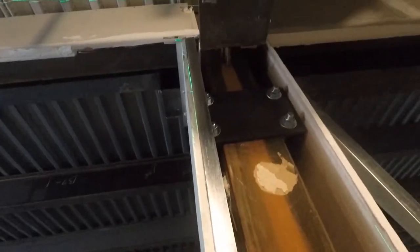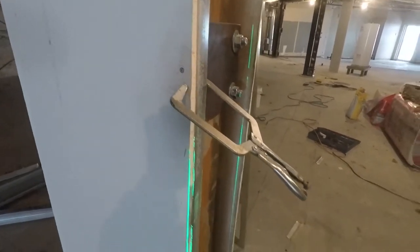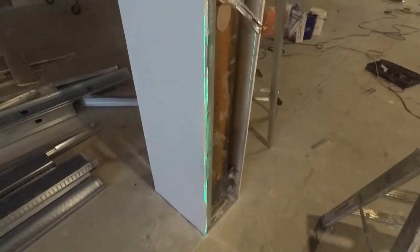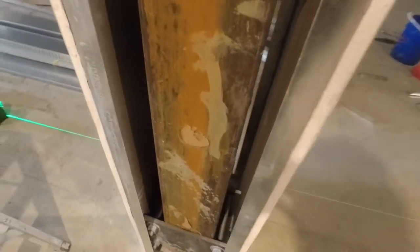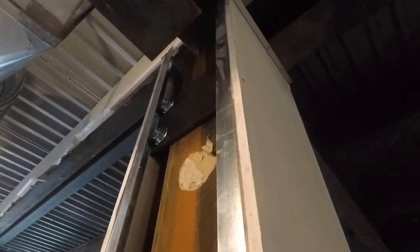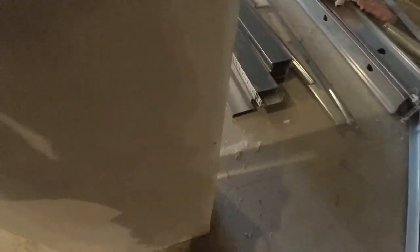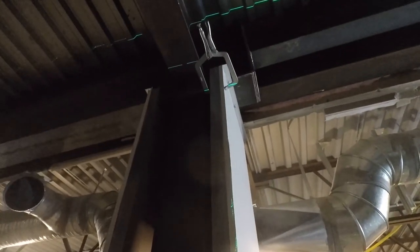I'm clamping the angle for the face pieces, clamping it and screwing it in. I didn't have to pre-frame this — all I had to do was shoot the bottom angle and the top angle on two sides. Now I'm screwing in that angle. Look how tight that is. These are the smallest possible columns you could absolutely have in this situation. Always think about that. Just use your lasers and attach your steel at the top to what you can. All you need is two sides secure to the structure up there, and you're golden. The other faces — boom.